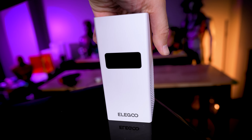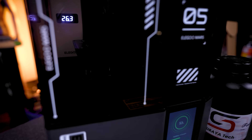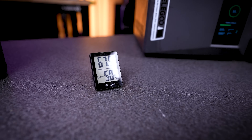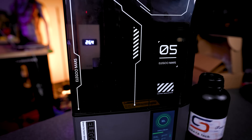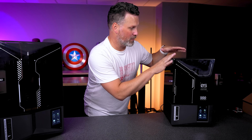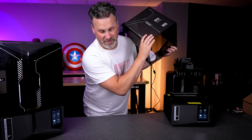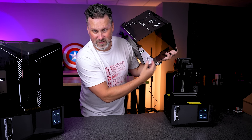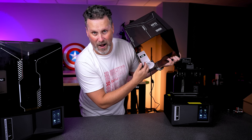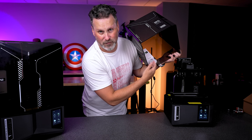There's also no way to set it to Fahrenheit. Ideally, I would have loved to have seen these built directly into these 3D printers, or the best solution would be where it actually heats up the vat. These actually heat up the entire print chamber, so I'm going to be interested to see how these fare with printing things with supports or larger models. In theory, this could also work on other resin 3D printers or older Mars 3D printers — however, it's probably going to need some kind of printable stand, because there is a fan sucking in air on the bottom, and you're going to need something to lift it off the surface so that airflow can feed into it.